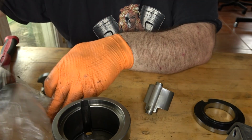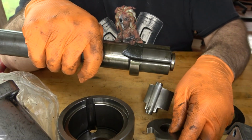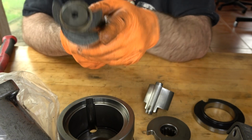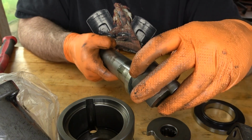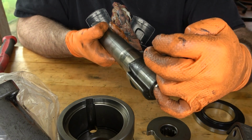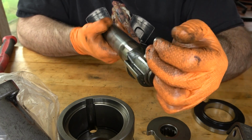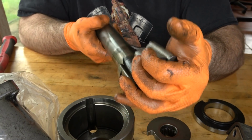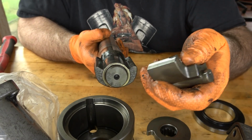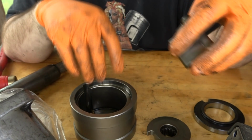And then the anvil is just this big old anvil, and when this gets inserted in there, the dogs on the anvil here are what engage the hammer, and the hammer can pivot because it has that large pin. That hammer can pivot depending on which direction the anvil is moving in to move one side of the hammer out of the way while the other side of the anvil impacts it. So it's a clever little design. And this is a lot of material here because it's such a big, beefy unit. So everything in here is going to get some grease.